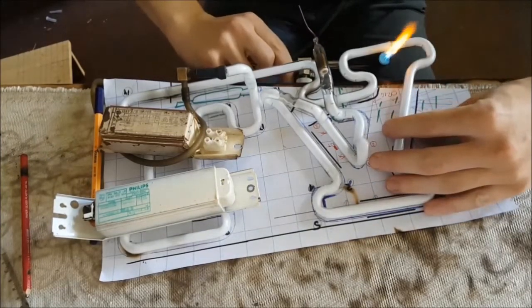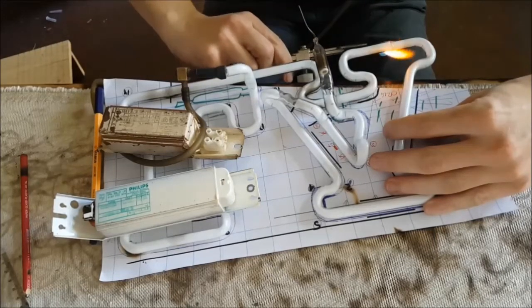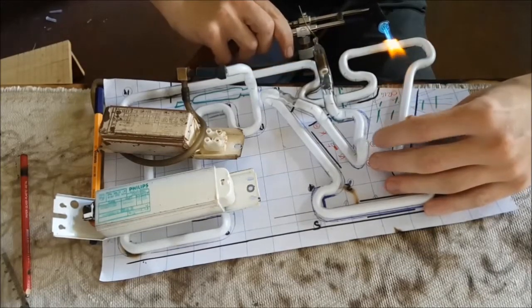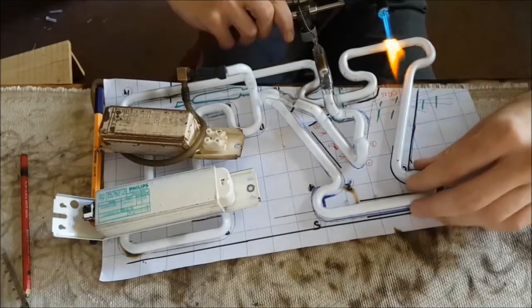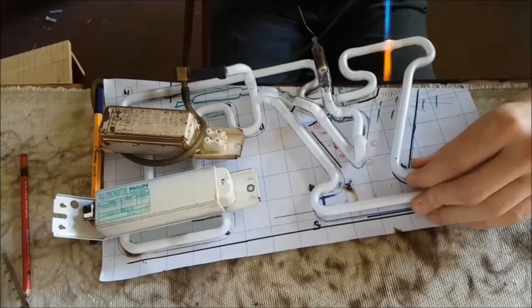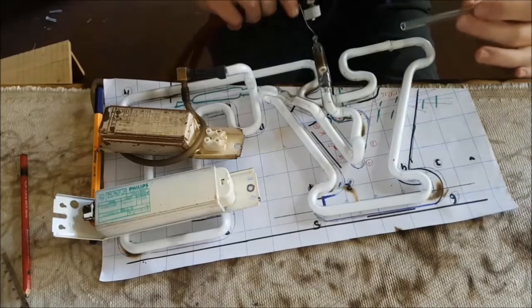And the problem happened. There's a hole in the top of the weld, and because I can't lift that tube up to push the hole closed, I'm trying to use a trick that a glass bender told me. He said always have a very thin tube of glass ready, then in such a case you can just melt a little drop of glass off of that and close the hole.